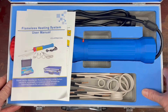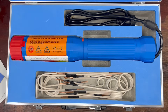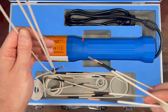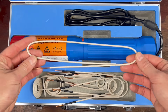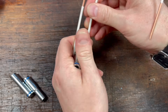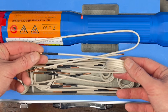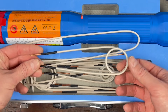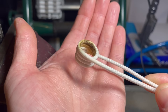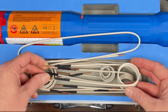The kit comes in a really lovely sturdy case, well padded and lockable, which is convenient. You get your user manuals, the tool, and a selection of different coils. One thing I really like is they give you two coils that you can wrap around to whatever shape or size you like - I used a socket to do so and it gave me exactly the size I needed. To get the most out of an induction heater, the more wraps the better, and ideally a small gap between the part you want to heat and the coils themselves - a small gap will increase the speed at which the part heats up.